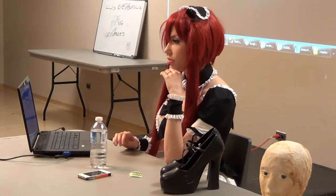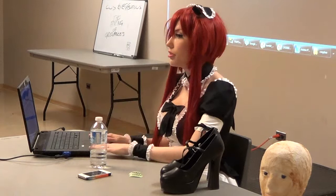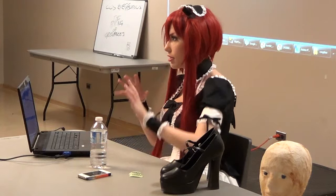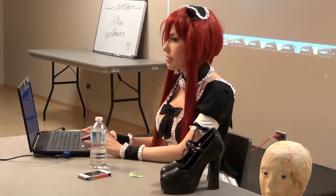It's definitely very good. And I would also recommend doing molding and casting, especially if you're using any kind of fiberglass or gel coat, outside because it makes ventilation nice. Silicone's pretty benign. There's not really any fumes. I would ventilate your house if you do it inside. But in general, because molding is a really messy process, it's better to do it outside if you can, or in a garage or something.